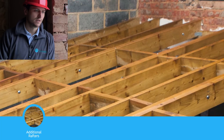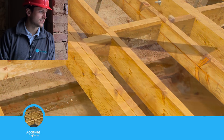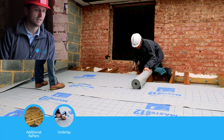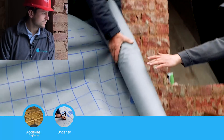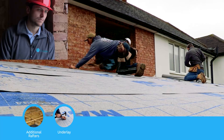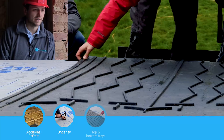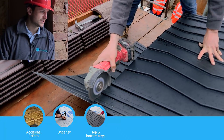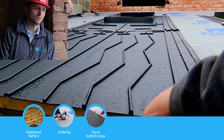We're always governed by the existing house. This is an add-on, not a new build. This was designed for a 10-degree pitch roof — actually designed theoretically to leak, because it falls onto the trays and the water runs down. Because the roof window is only guaranteed for 15 degrees or above, and most pitched roofs are generally over 15 degrees, this is a low-pitched roof.